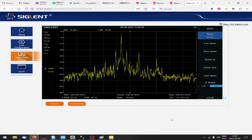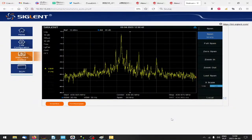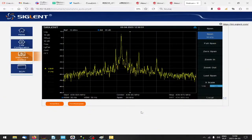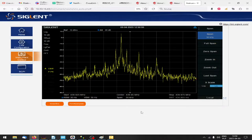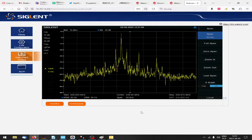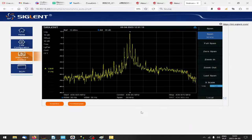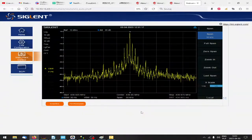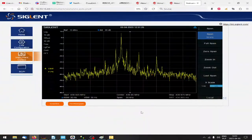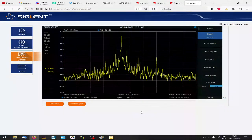I also have a two-channel signal generator. The first channel is the 18 MHz clock for the FPGA, and the other channel is used for the modulation input - the modulation output from that generator is connected to the ADC of the STM32. The STM32 is used to sample the baseband and pass the data over SPI to the FPGA. Right now the configuration looks like this: the FPGA runs on the NCO that sees just nothing at the output, so the ADC input is just floating.